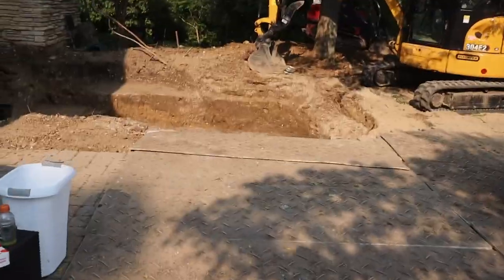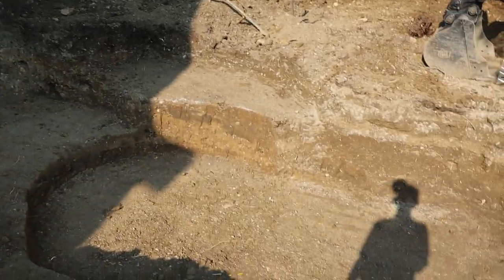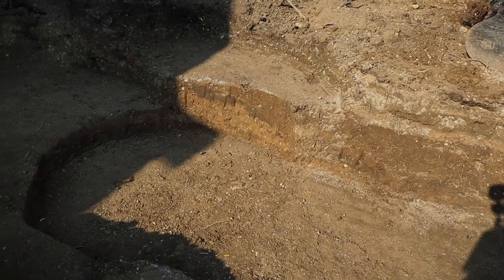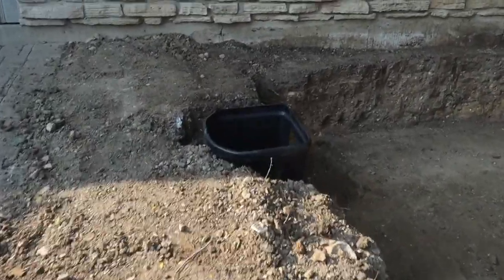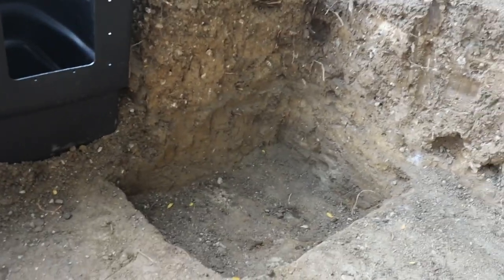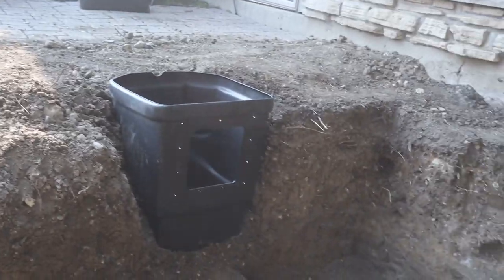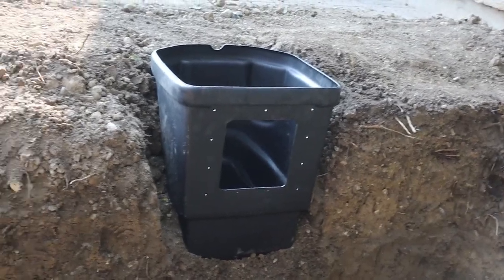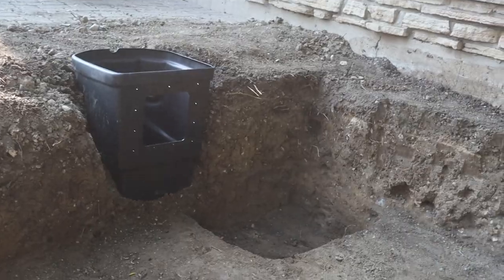Let me show you what we got done today. We got everything done that we wanted minus the fabric and liner, which is no big deal. We ran into an issue — we ran across the sewer clean-out that runs from that clean-out over there all the way to this one. We were able to get our entire hole excavated, but unfortunately weren't able to go down our full three feet. We were fortunately able to go down two and a half feet, so we only lost six inches. We got our trench dug for our wall, our skimmer in, and over here we have a vault going inside the pond. We're putting two small aqua blocks in front of the skimmer so the rock work can disguise the face of the skimmer and the pondless vault, and give the skimmer support — we don't want it to heave out during a clean-out.